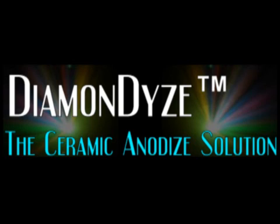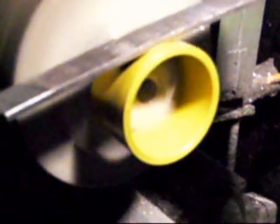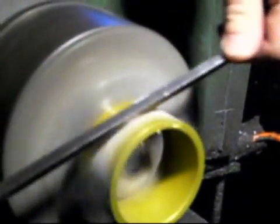While the photos are a little blurry, as the files are shown to you, what you're seeing is damage to the file, not to the Diamond Dyes part. What looks like damage and discoloration is really the teeth from the files. In fact, you'll see sparks off of the second file — aluminum doesn't spark, steel does. This is the damage occurring to the file.